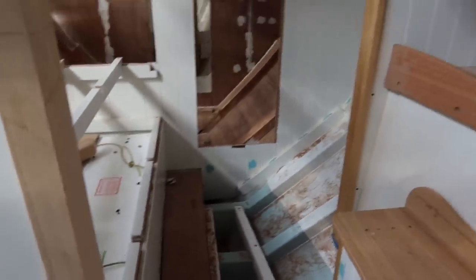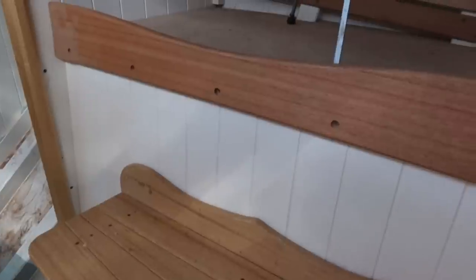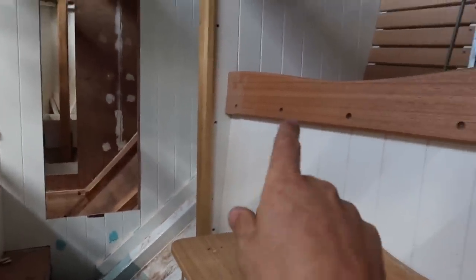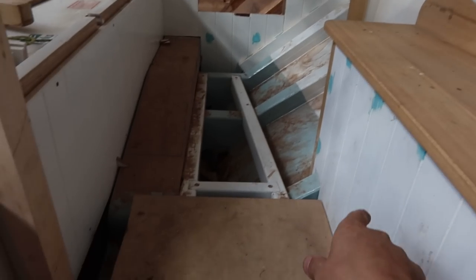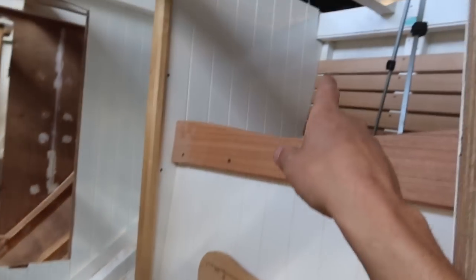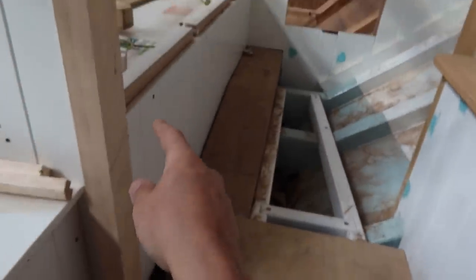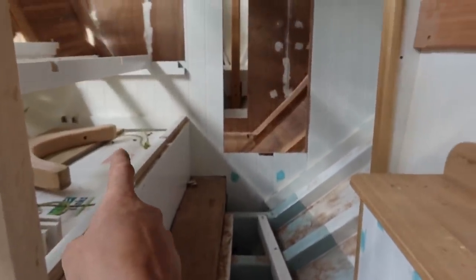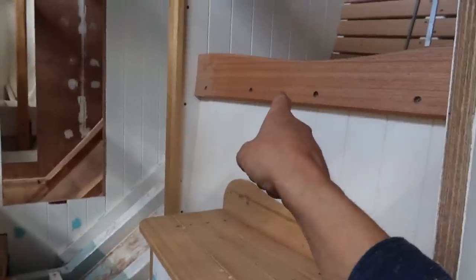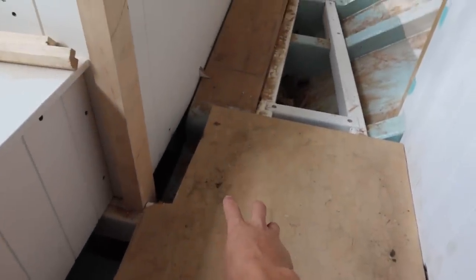And our other tank is under there on the starboard side. And they're actually going to be connected. So this one is slightly higher. Pipe will come down and tap into that one. So we're only going to have one filler. One filler comes up here and it fills in. There'll be a breather obviously at this end and a breather at this end of this one. And then our takeoff will also be our fill.